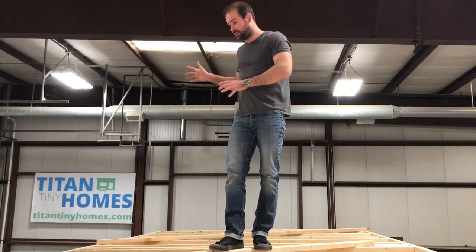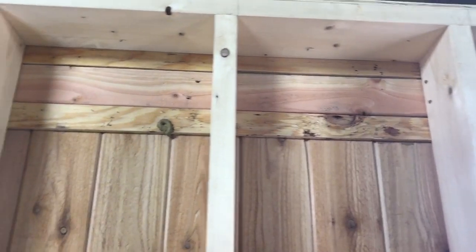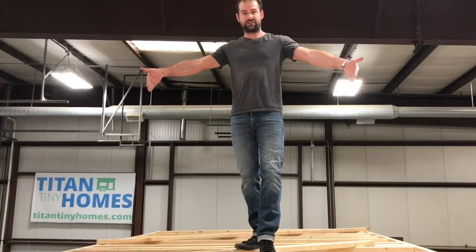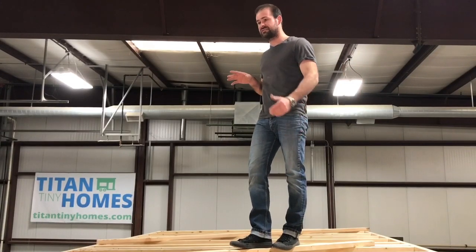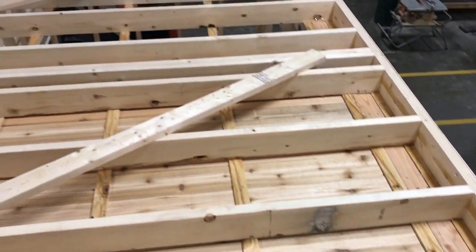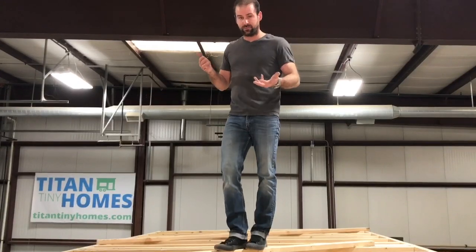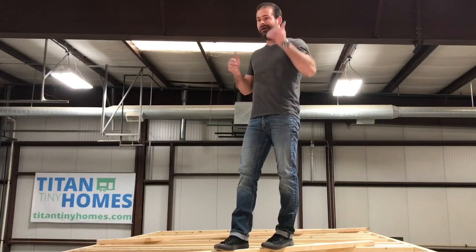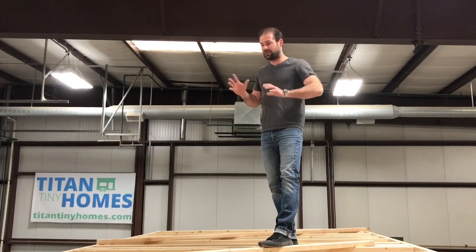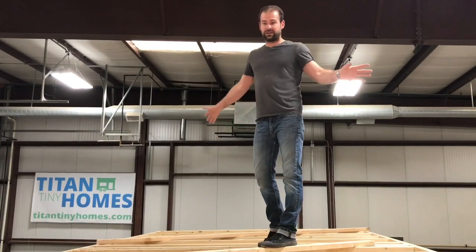Now let's head up to the roof. You'll see an entire roof constructed out of two-by-six material — not two-by-fours — because it's wood, so we have to pay close attention to our spans. This roof is actually built in three sections. It's a very easy way to frame these roofs on the ground. When building a tiny house, sometimes you're by yourself or have just one other person, and laying all the joists out across the full span takes a lot of time. Building the roof in three sections on the ground and then putting it up saves time and makes things easier.